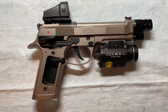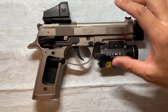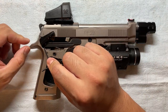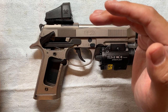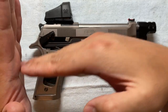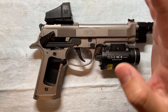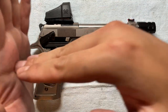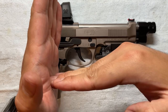Alright, that was Part 1 — polishing the hammer. After polishing, I realized it helped a lot: it smoothed the contact surface between the hammer hook area and the trigger bar's rear significantly, and I could see it moving way smoother than before. But it did not completely solve the problem — after racking the slide it was still having difficulty moving up and still staying below.